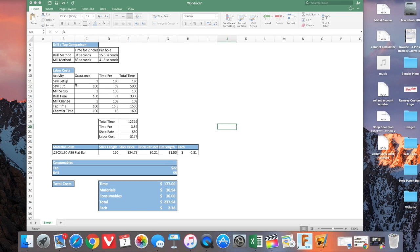I didn't really show the time to do this on camera, but to do the saw cuts of this material, there'd be a one-time occurrence of the setup — just getting the stop set up, getting the piece placed there — and I allowed three minutes or 180 seconds for that. That's a one-time hit. The cut itself: 59 seconds each to get those cut. I think we could probably improve on that a little bit, letting the saw go through at a reasonable pace and not push it.